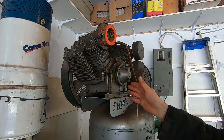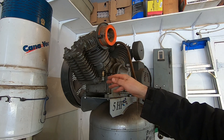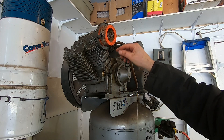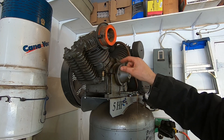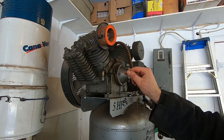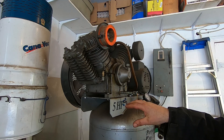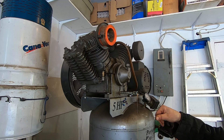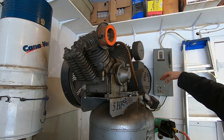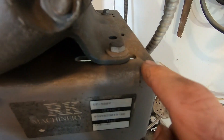If you have one of the better air compressors that's not direct drive but instead belt drive, you want to make sure your belts are in good condition and set with proper tension according to the manufacturer's instructions. From top to bottom, if you push the belt down and up in the center between the two pulleys, maybe a half inch to three-quarter inch play — something like that. You don't want those belts super tight because if they're tight, they'll prematurely wear the bearings on your motor and possibly on your pump. Usually what happens is the mounting bracket for the motor is slotted and you can release the bolt and slide it back and forth to get it to the desired tension.